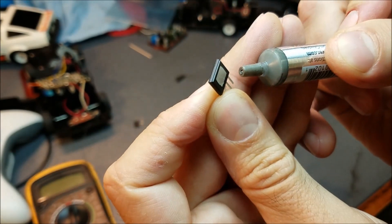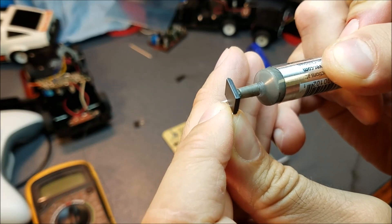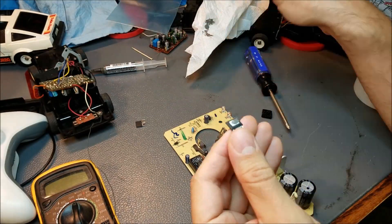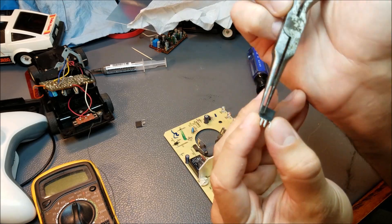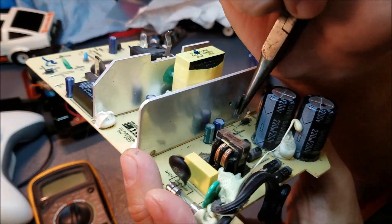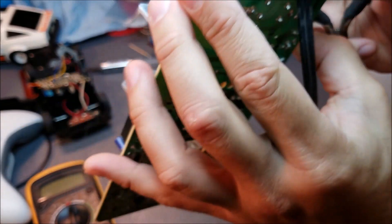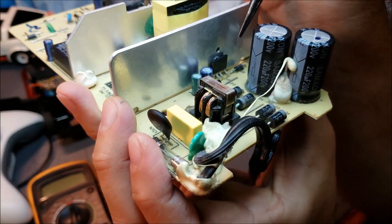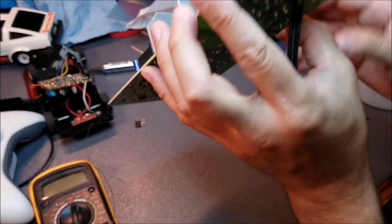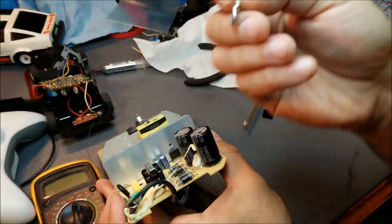I want to apply just a little dot of thermal paste to this. Thermal paste is conductive, so you don't want it touching any of the pins or contacts once it's been squeezed out the sides. I found that the easiest way to hold this chip was to hold one of the protruding legs with a pair of fine needle-nose pliers, and then just drop it into the holes. The goal is that I want it completely installed onto this large aluminum heat sink so that when I solder it in, everything will be in the correct place. This is the clamp that holds it down onto the heat sink.